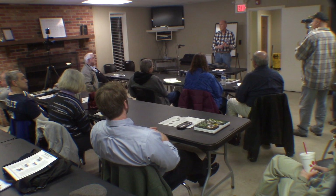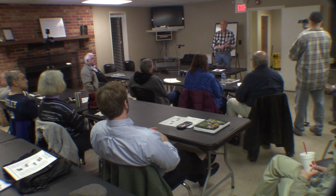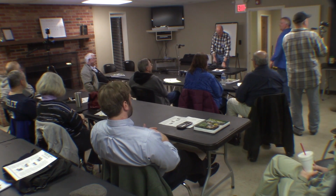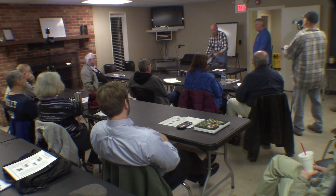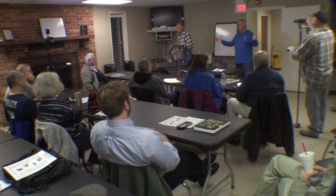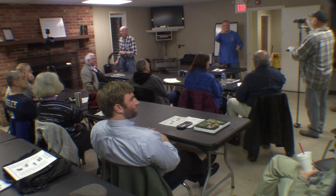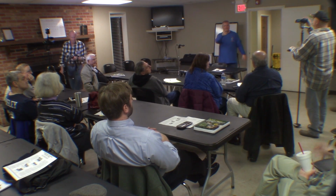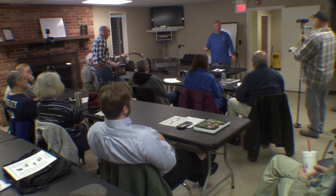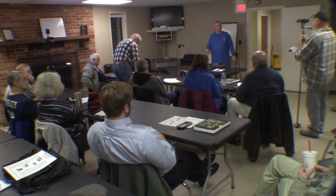Any other questions? As I say, you're welcome to have a look at any of this. Greg, thank you so much for coming in and sharing with us tonight. Anybody else have some words of wisdom for us on connectors? Oh, and the silver connectors usually have Teflon insulators, which are much higher temperature, with better breakdown and arcing resistance. Yeah, good.